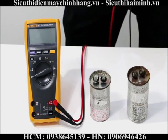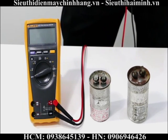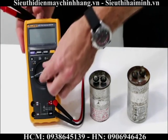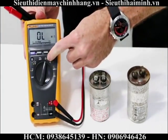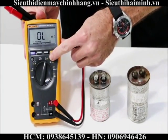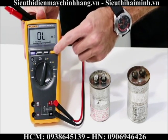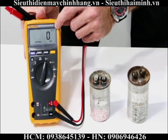I have two capacitors here: one is 25 microfarad and one is 35 microfarad. I know that one of these has failed. I need to turn my rotary dial over to the resistance and capacitance function. The capacitance function is highlighted in yellow, so I press the function key to move over to the capacitance function.